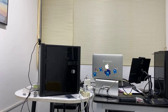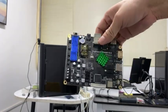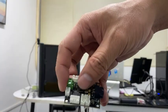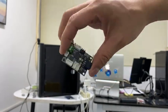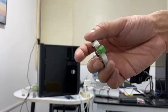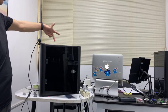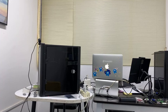And one more time, let me show you the printer mainboard and the microboard. This mainboard is inside the KLP1 and the KP3S Pro V2, and of course the microboard has an ADXL345 acceleration sensor. This mainboard is in the tool head. Both models have a 5:1 gear ratio, and you don't need to load the filament manually. You just put the filament in and let the printer extrude it and then retract. Of course, we're going to show you tutorials about every step of the printing use.